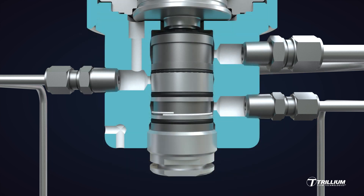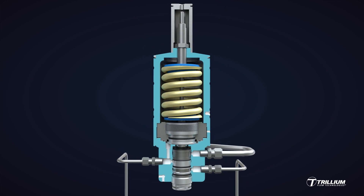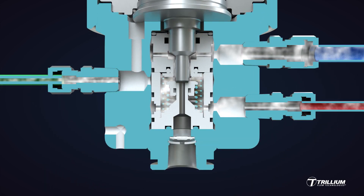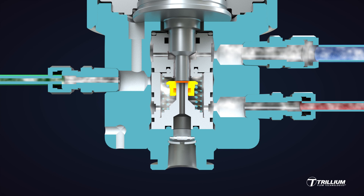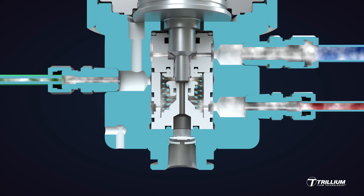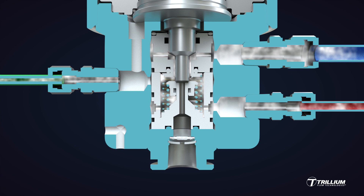Let's now take a look at the pilot. The DMS pilot contains not only a piston which is connected directly to the static sensing line, but also upper trim components. The trim parts are separate from the flowing medium whatever the position the valve is in. This improves its capabilities in handling dirty service applications and reduces maintenance costs during the life of the product. The important parts which allow the pilot to snap in either a balanced or unbalanced position consist of the disc, which is able to slide on the exhaust nozzle.